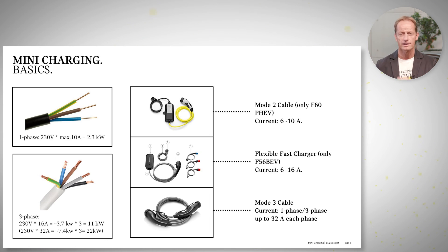If you have a three-phase cable, you've got a 16-amp fuse — remember that from last time. So 230 volts times 16 amps ends up with 3.7 kilowatts per phase. You've got three of them, so your total performance is 11 kilowatts.